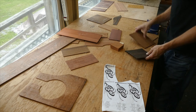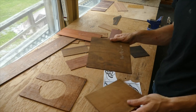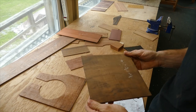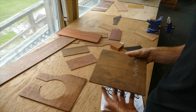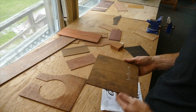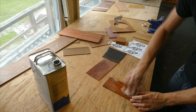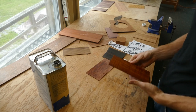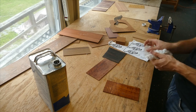You don't have to have any sort of banding at all. Here are some great woods. Imbuia — I think that's how you pronounce it — an interesting wood that I've been collecting pieces of when I find it. It has a sort of cloud-like and ambiguous appearance grain-wise, and color-wise it's a nice sandstone brown. What I'm doing here is rubbing some mineral spirits on the wood, and what that does is make the grain and the figure really pop so I can make my decision based on what it looks like after the finish is applied.